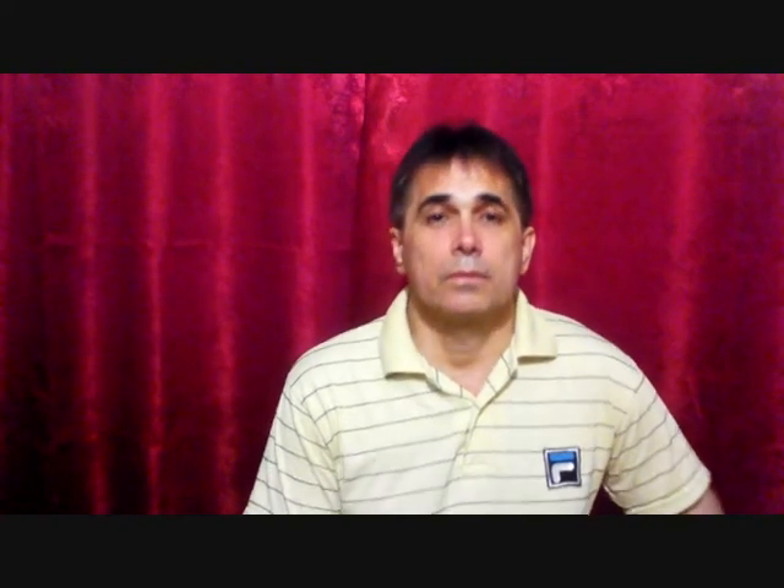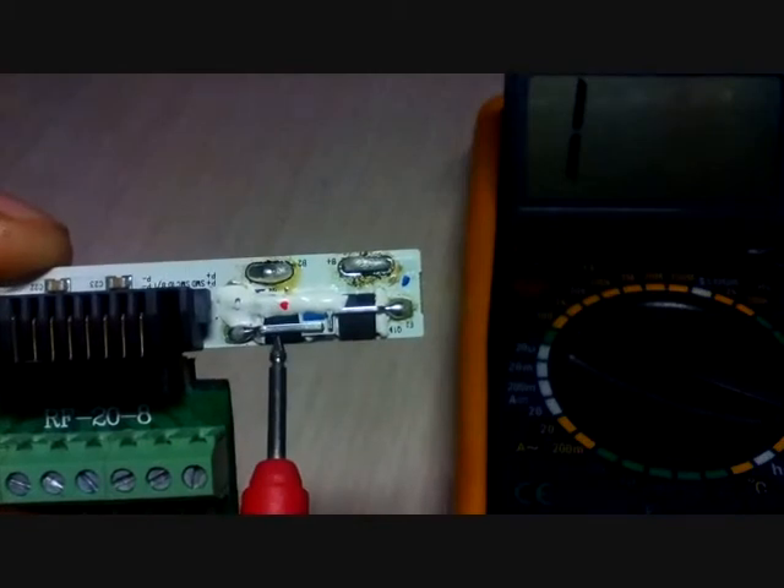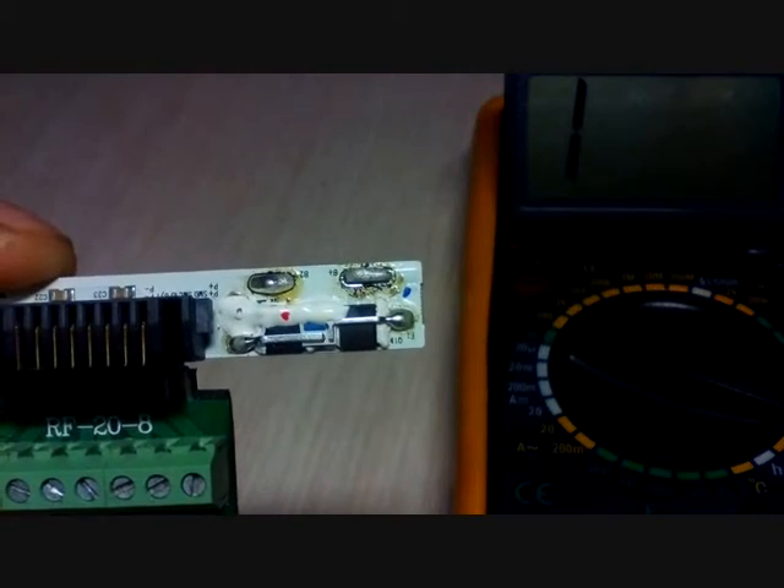While our cells are balancing, we will continue with the PCB. First we need to check the fuse. We have a voltage-controlled fuse with three pins: one pin is control to burn it, and two pins are main power pins. We need to check if the mains are short — if current can pass through the fuse. This is the fuse, this is the control pin, these are the power pins — they must be shorted. Let us check.